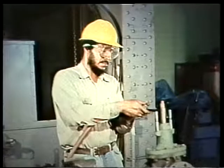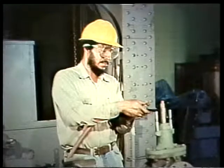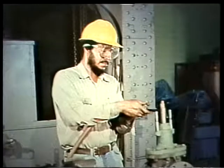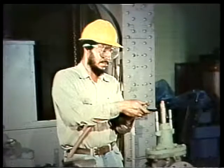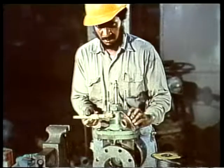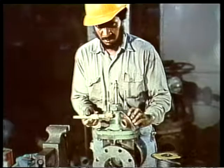During routine inspection, valves that need it should be cleaned and lubricated. When cleaning a valve, remove all dust, dirt, and chemical buildup that could interfere with the proper operation of the valve, especially on the stem and around the packing gland nuts. Be sure to lubricate these parts after cleaning them. This will keep the valve in good working order. The stem will rotate freely when needed, and the packing gland nuts won't stick when adjustments are made.